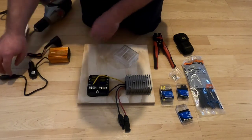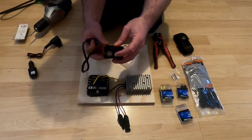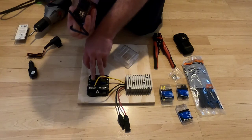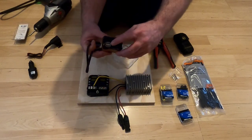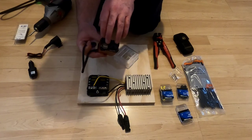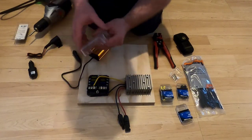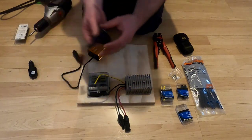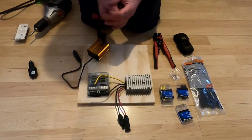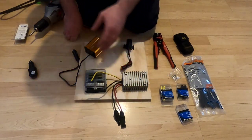I've got a small 150 watt AC inverter which will convert the DC power flowing through my fuse block out to wall power and USB, so I'll have the capacity to run or charge from either. I also have a 12 volt cigarette lighter plug adapter that will be wired into the fuse block as well.